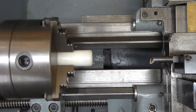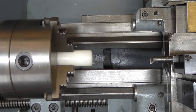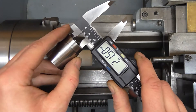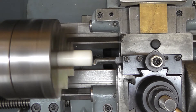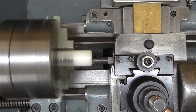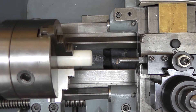Looks like a reasonably convincing number so I'm going to punch that in — helps if I use the right button. There we go. And the inside that we're looking for is 21.5mm, so we haven't got much to take out. In fact, I'm going to go straight for 21.2mm.